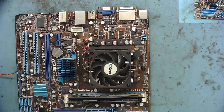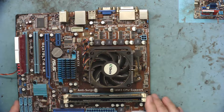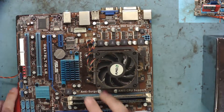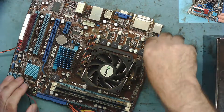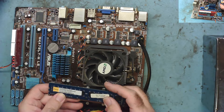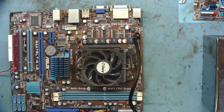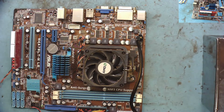Let's stick the POST analyzer card in as well. We've got the motherboard, let's test it out on a firm base. We'll take the RAM out first — looks like a pair of two-gig sticks, so four gig total. More dust. Power supply is on, switch is ready, and the speaker is now connected so we should get some beeps out of this.